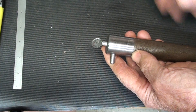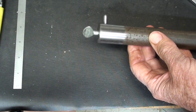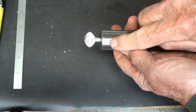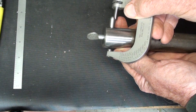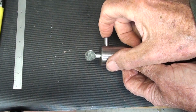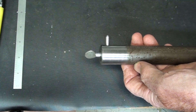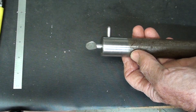Do you see why I couldn't use the boring bar for that? It has a hole that goes all the way through, because the anvil of the micrometer would fall into that hole. This feeler could be used for many different diameters, or you can make different lengths of rod. But if your work is really small, you're going to need to make one of these feelers that is smaller in diameter. Now let's go out to the lathe again.